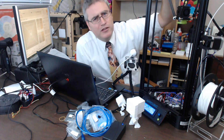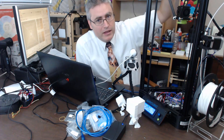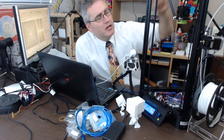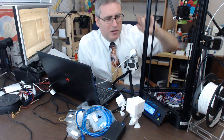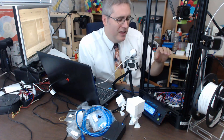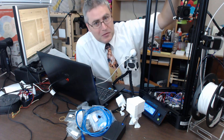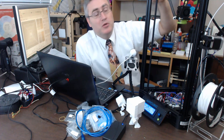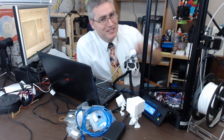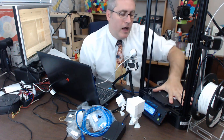The end stops are up at the top, which I think is unusual — most 3D printers work by dead reckoning from the bottom. But where would they go at the bottom on a delta? Regardless, I didn't rotate those end stop cables and it caused a problem. It went up, said 'this one has touched' when it was actually that one that had touched, so it kept moving the other one up — skipping steps. That was a bit of a headache and I had to re-rotate those cables.